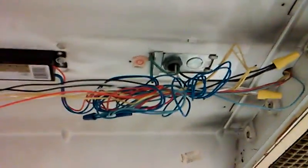On this particular one, it's got that little shield there, so we don't have a lot of room. When you've got to put these wires up, you've got to make them fit pretty much in this area right here. I've got my wires tied up pretty good there. Let's use some of the excess wire and wrap it around. I've got our cover back on. Let's put some bulbs in there and see if she works. And there we go — 8-wire to 5-wire system. See you, y'all.